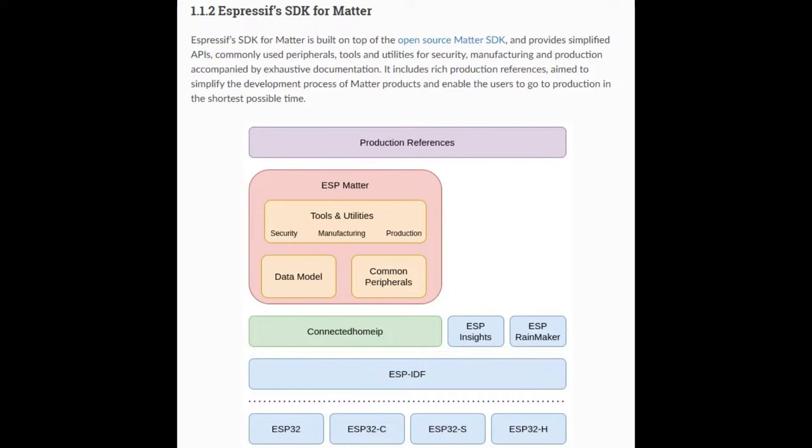You'll need to use the ESP SDK, also known as the ESP-IDF — I think 5.2 is the latest version. At this moment there's no Arduino support for programming Matter, so you'll have to use the bare SDK. Not that it's complicated — you can use PlatformIO, and they have instructions for every operating system. But this is a C/C++ path, so you'll need to make sure you've got your toolchain set up and a lot of command-line work.